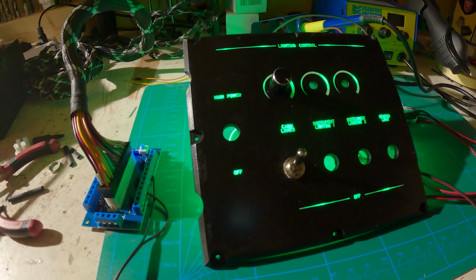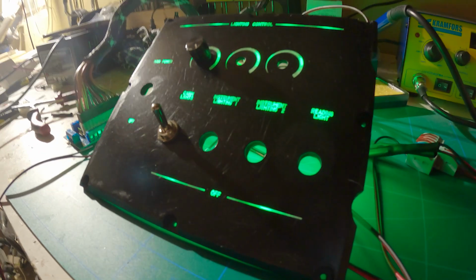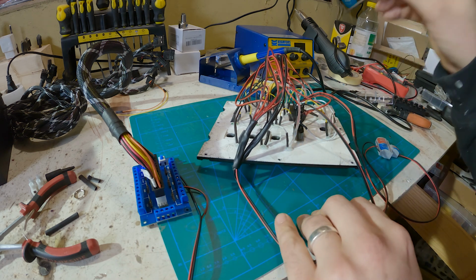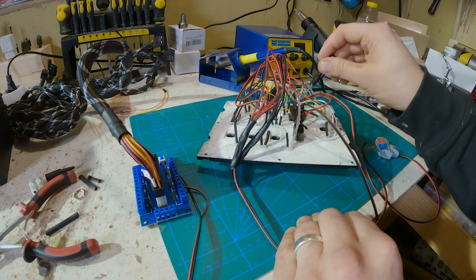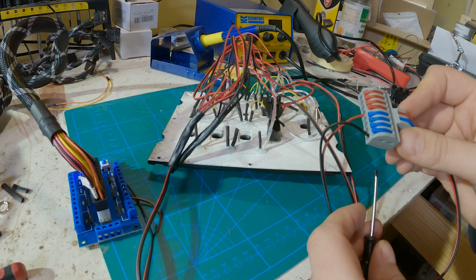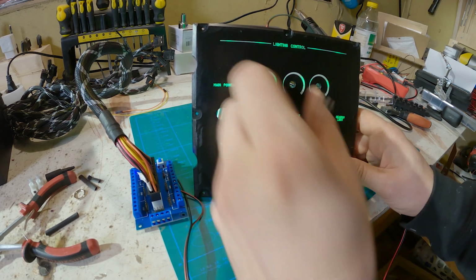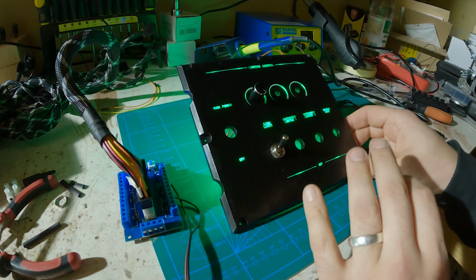And after the LEDs, it was time for the switches. Okay, now that I have one circuit in place, let's go through the setup. First, I have the breakout board here. The negative wire is connected straight to the LED dimmer, and the positive wire to the switch, which is connected to the LED dimmer. And then the LED dimmer is connected to this thing where I can attach single panels. And from here, all the wires go to the LEDs. And now I can easily flip the switch, and it has power, and I can also control the brightness here. So now it's time to add the rest of the circuits.